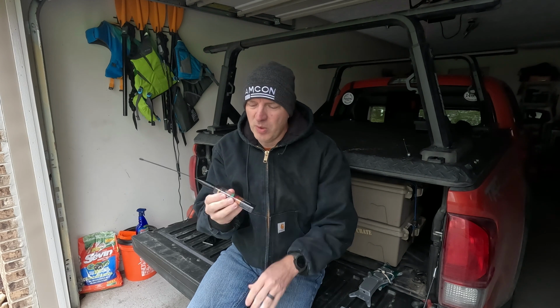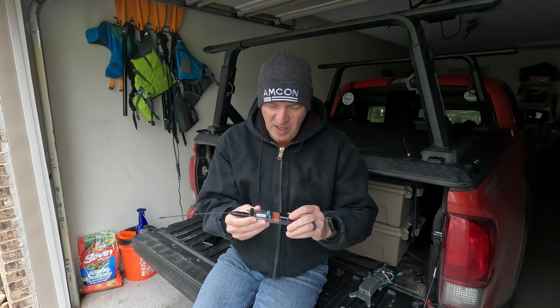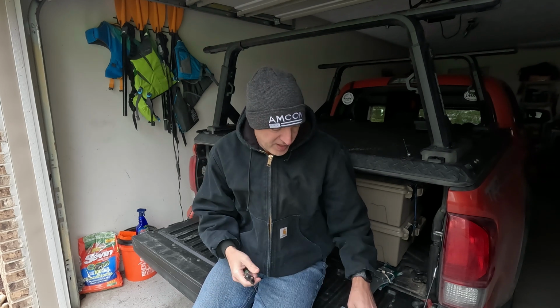But I've already worked on this and programmed it. I got the programming cable with it. I did have some trouble when I was setting this up initially, and it wouldn't recognize the COM port. It recognized the cable COM port, but the software didn't, and that was because when I plugged the cable in, it came up as COM15, and apparently the software is limited in how many COM ports it recognizes. It doesn't recognize COM15. So I just renumbered the COM port to COM2, and I was able to program this with my club's information.